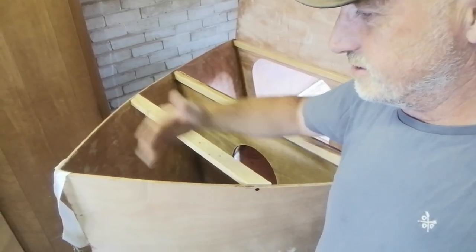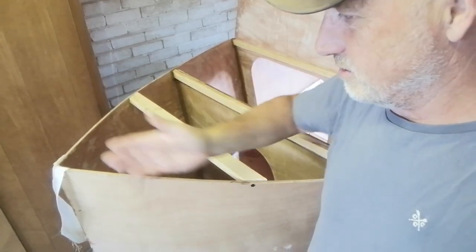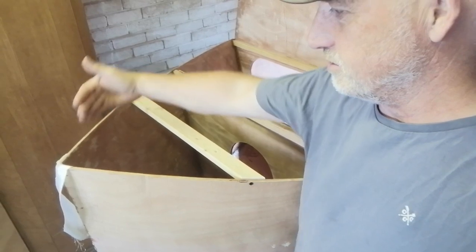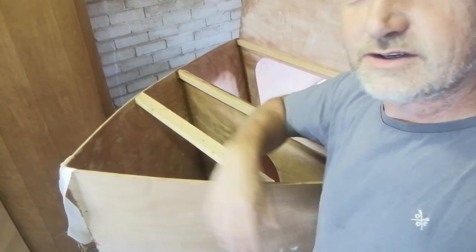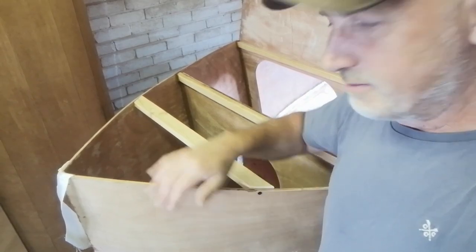After fitting the transom I put something called the lower breast hook into position, which fits right in the bow of the boat, and pulled that together with a clamp to get this quite blunt point onto the front of the boat. Because that will be in the way of the fibreglass work afterwards, once it was held in position I cut a spreader stick to hold that shape and put a couple of temporary screws in the sides just to hold it in place.